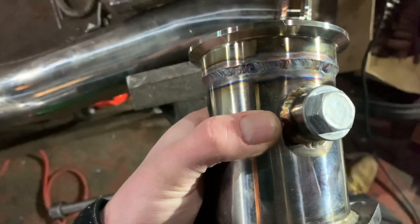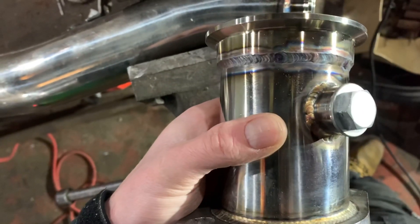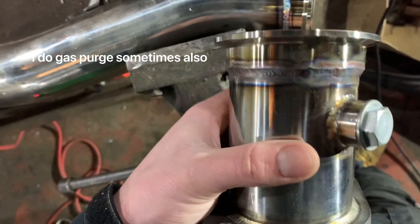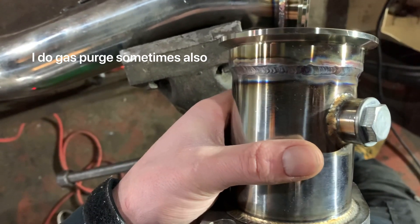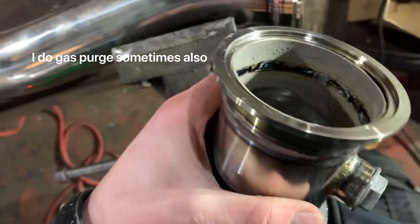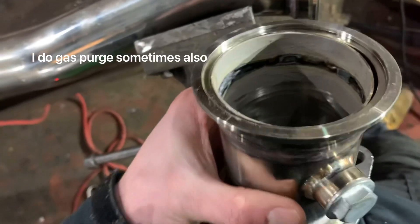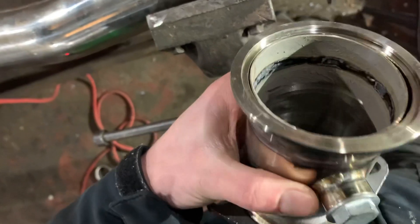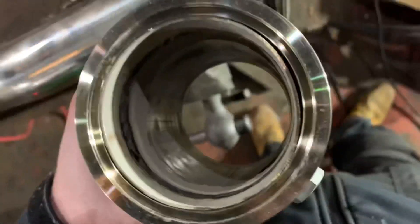Here's the other side of the joint on that V-band — the other flange. The bead came out pretty nice. I'm just using the TIG and I've got a 1mm 308 wire on there that I'm using for filler. And I'm painting some Solar Flux on the inside. It's quite a good product really — saves a lot of wasted gas. Apparently used to use it a lot on aircraft stuff, don't know how true that is. But as you can see the bead's not pushed through too much, no sort of oxidation on the inside.